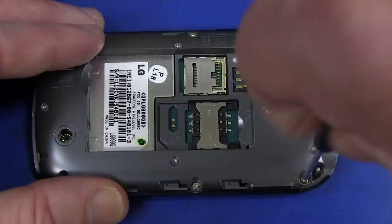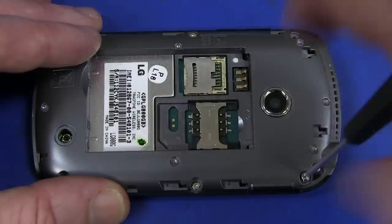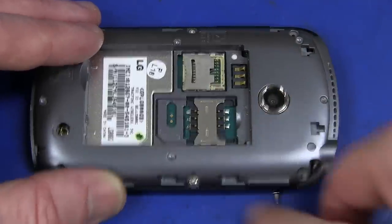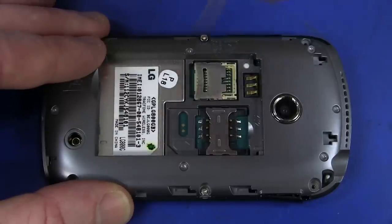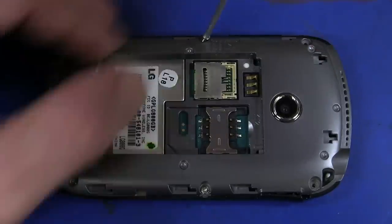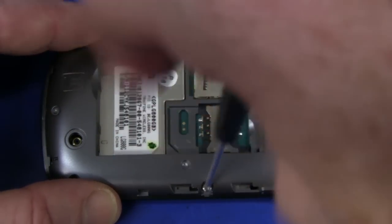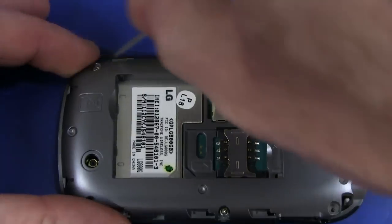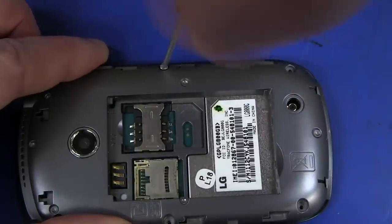Now with a real bare bones phone like this — it's not a smartphone, by the way. I don't think anyone would classify this as a smartphone, even though you can run some sort of app on it. It's certainly not Android or Apple OS, that's for sure. We expect a high level of system chip integration in this thing. I'd be surprised if it's more than like a three chip solution. It's going to be the main ASIC in here, plus maybe some external memory and maybe an RF chipset. And of course it'll be a one board solution.